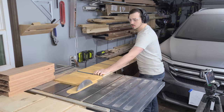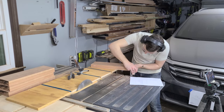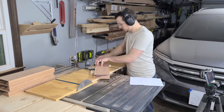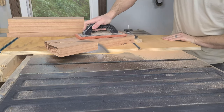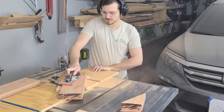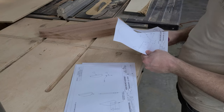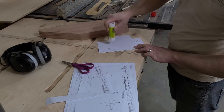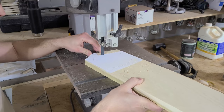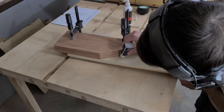From here, we start the trickier steps of shaping these pieces. First up is the large taper on the back. To do this, we mark out where the taper needs to be on one of our pieces and then position it on the tapering jig. To make this cut repeatable, we clamp some blocks to our jig so that we can put the next blank in the same spot to quickly make the same cut. These parts have some unique geometry on one face to slot into the bed frame, so we use a template to make this easier. Our DIY plans come with a template page that you can print out and glue to a piece of scrap for this end piece. Then we just cut on the lines of the paper and we have ourselves a template.